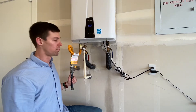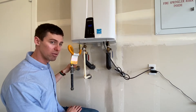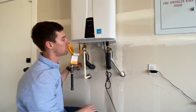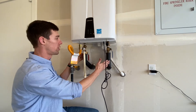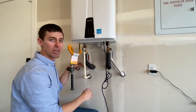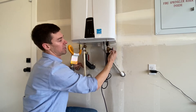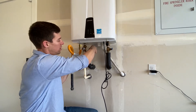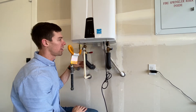Once you have everything ready to go, the first thing you want to do is cut your gas supply. Here's the gas supply — I'm going to turn the valve 90 degrees to the off position, and I'm also going to cut power to the unit by unplugging it. So you have no gas and no power supply to it. The only thing going to the unit now is water — you've got your inlet and your outlet. Cold water comes in, heats up, and comes down the outlet to the appliances in your house. The next step is to cut the water supply as well. Right now your unit has no gas, no power, and no water. It's safe to operate on and there's not going to be any surprises.